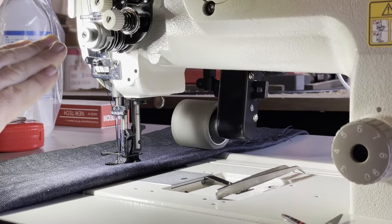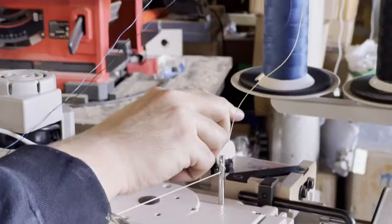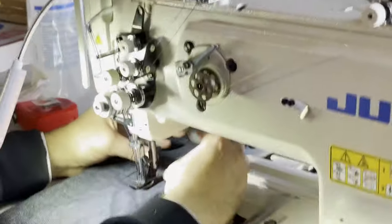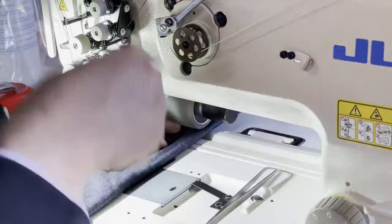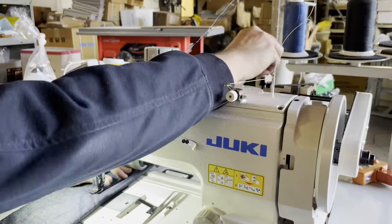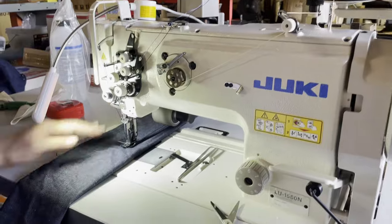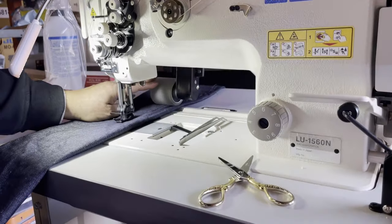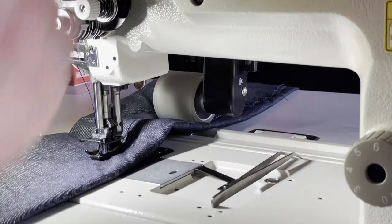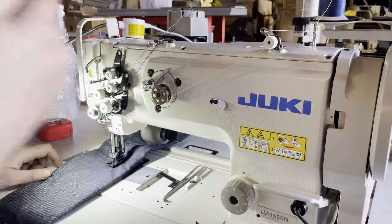According to the fabric that you have, you could adjust the tension from here. Like right before I came here to adjust, they told me that fabric is bunching up here. So I adjusted the tension. I gave it less tension. If you give it more tension, see, it's gonna be more press here, and then you see, things bunch up. Right? So I do less tension. What I'm trying to say, it has to do with what type of fabric you work with.